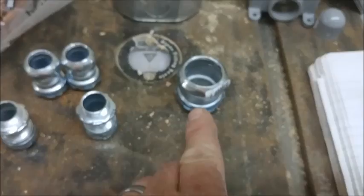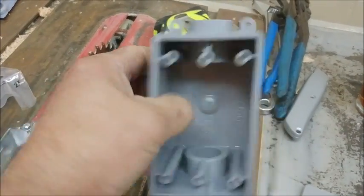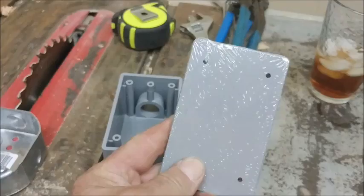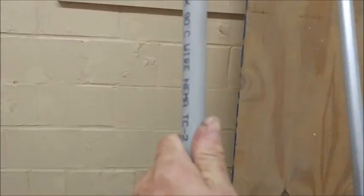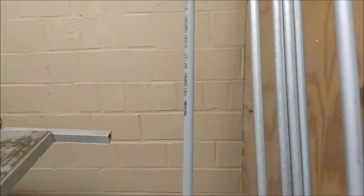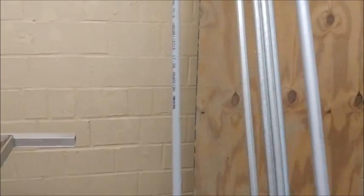Then I've got a one inch EMT connector, a three quarter inch PVC electrical box and a blank cover for it. For conduit, here's my half inch PVC — one piece — and here's my four pieces of half inch EMT. These I'm going to make my ground plane with; I think I'm going to cut them down to about eight feet and bend a 45 degree bend at the top, because you want them approximately 45 degrees to your main tower. The one inch EMT is just going to give me 10 foot above the ground before the main antenna. I'm living on top of one of the tallest hills in this county, so 10 feet on top of my roof — I'm above everything.